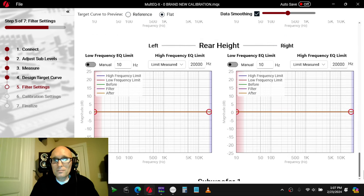But when you sweep your speakers, your subs, do you actually hear that? You don't. You don't hear it. And it's because it will just be an EQ to counter this whole thing on both sides being brought down as well. So we need to find this point. So yes, this is boring. And I literally go up 0.1 at a time. But you know when you've got the response that you need.